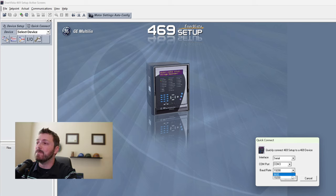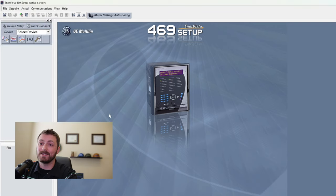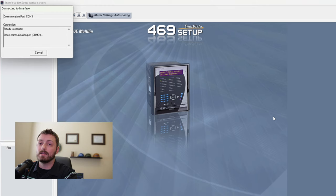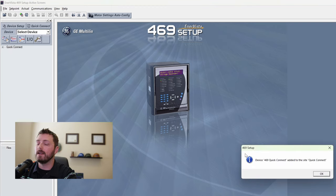Go to Quick Connect, select Device, COM 3. There aren't many baud rate options - 9600 or 19.2k. I couldn't remember which one it was, so I tried one and got 'failed to connect,' so it's the other one. It's 9600. That's really all you need to know - connecting to these is a little easier than SEL relays; it's just making sure you have the right software that's the pain.